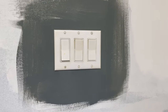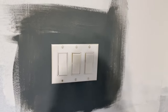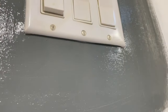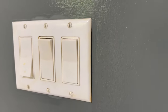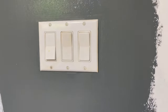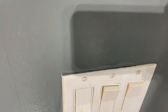So you think to yourself, 'wow that was fast and super clean.' The only problem is a lot of that is just movie magic. Look at the top — there's a ton of paint on the top, wavy on the sides. It's not great. If you were living in here this wouldn't be acceptable. This is why in cases like this we always recommend: if the thing you're cutting around can be removed, just remove it. It will always look better and it doesn't take very long. You don't end up with stuff like this.